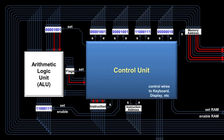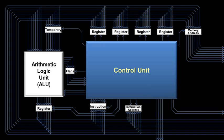So we'll add the final four wires to our CPU, which are used to control the external devices like the monitor and the keyboard. We now have a nearly complete picture of what the Scott CPU looks like. Data moves around inside the CPU using the bus and is stored in each register according to how that data is going to be used. Each instruction can be processed by the Scott CPU in about six clock ticks. Modern CPUs can process multiple instructions per clock tick, meaning that the computer you're using to watch this video is likely processing tens or even hundreds of billions of instructions per second. That phenomenal speed is accomplished by using more than one of each component and making sure all the components are active as much as possible, making modern CPUs much more complicated than the Scott CPU — but they are still fundamentally doing the same things.